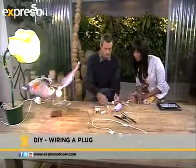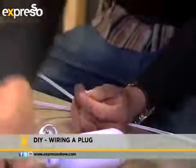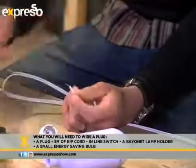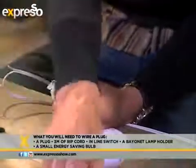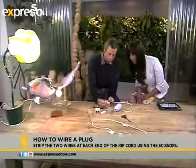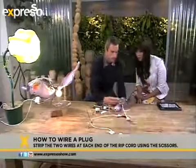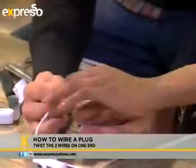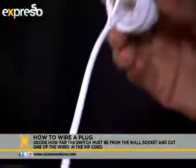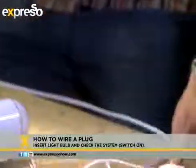Okay, all right. So let me show you. At the end of the wire, it'll come out as two bits of plastic like this, which we then cut around with a sharp bread knife or butter knife, and we have two bits of copper wire that are exposed like that. Using a bread knife or a screwdriver if you have, you can then loosen these screws here, insert the wire in, any one, and tighten it up. Once that happens, it looks like this. So both wires are in, nice and tight. And then we can close it up just by simply screwing the cap back on. Remember, we put it on first. That's quite important. Oh, that looked easy enough.